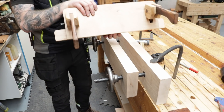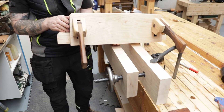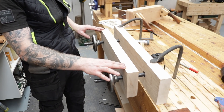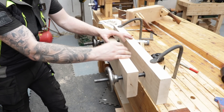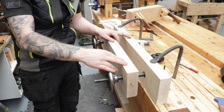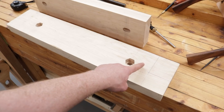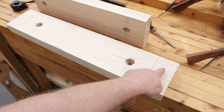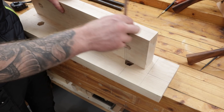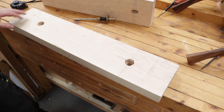I'm going to keep this one square-looking and put a chamfer on the front of the vise. Because it's such a thick front jaw, if I want to keep my piece clamped close to the jaw and still get in with a saw, a chamfered front is helpful. I've marked the section to cut out — the width of the front jaw and 60mm up — and marked a 20mm line with a marking gauge for the chamfer. I'll cut the notch on the bandsaw and work the chamfer with a hand plane.